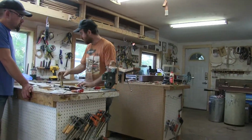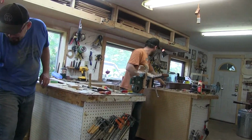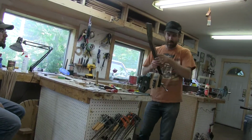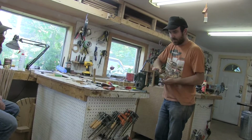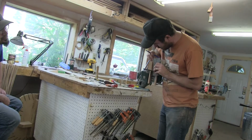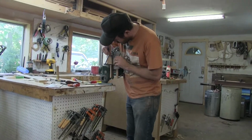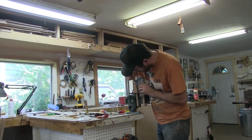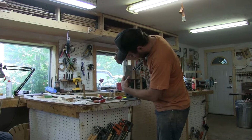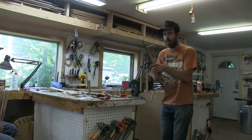And then I'll take a pencil and a 6-inch ruler, scraper for a true edge. I'll line up the fingerboard. In fact, I'll put it so you guys can see more easily. There's my beginning of my heel getting roughed out. So my heel is going to be along this line here, and be along this line here. So that's where I'm going to be lining up my chisel.